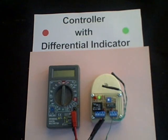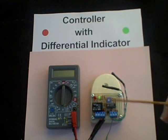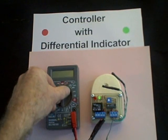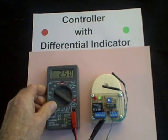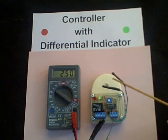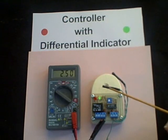When the temperature reaches a set temperature determined by this differential pot adjustment, the red light will come on and it will activate the relay. Let's take a quick look at the actual voltage at the common junction — we can see it's 2.5 volts. That means it's midway between 5 volts and 0 volts, and both probes are at the same temperature.